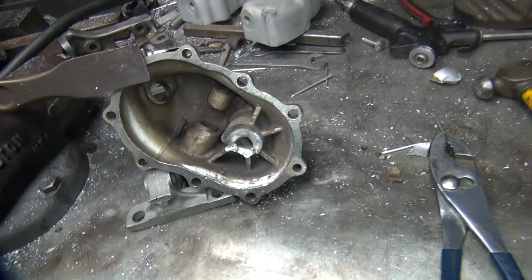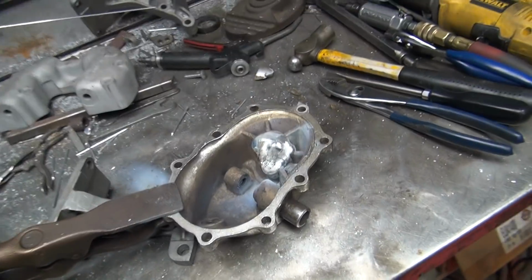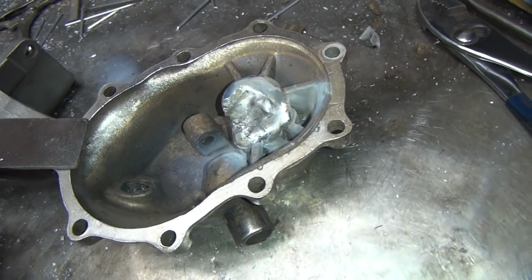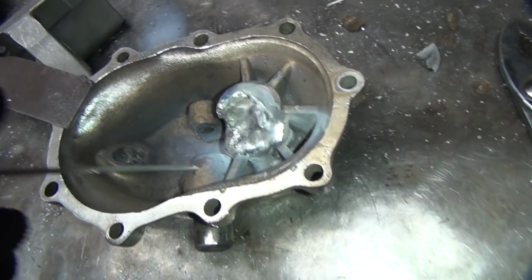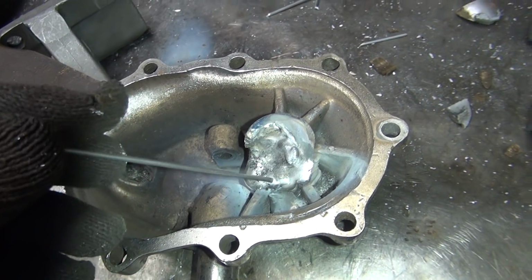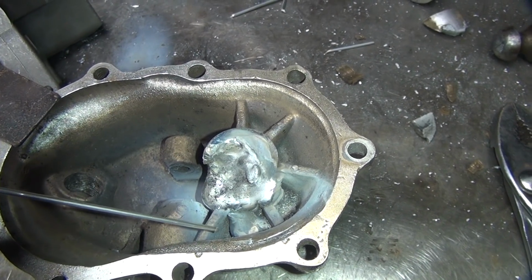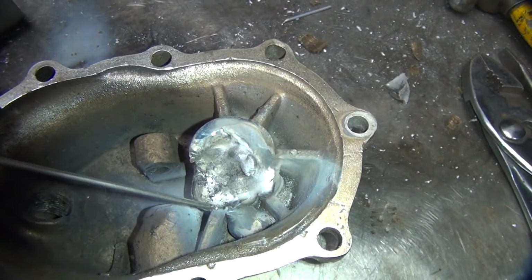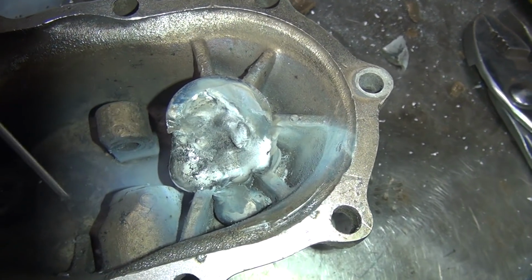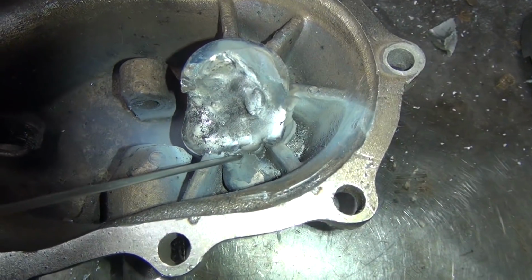Alright, try it out, look at that. Okay, I had a crack, I was welding up on it. The crack is going down right through here, so I'm trying to get weld on there, get it to blend in. I was just about done. Then we let off the trigger and start pulling the heat out of it, start laying rod in it, and all of a sudden, boop, the whole bottom dropped down. So I blew a big window down over here, and blew the whole bottom out.